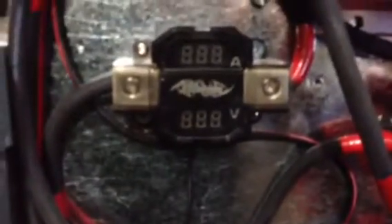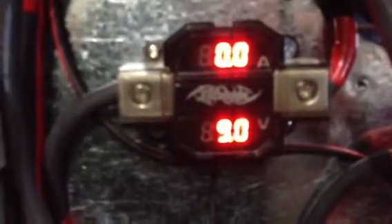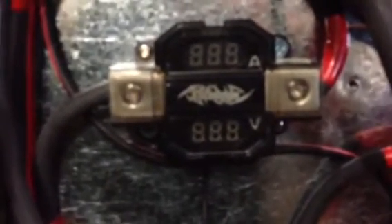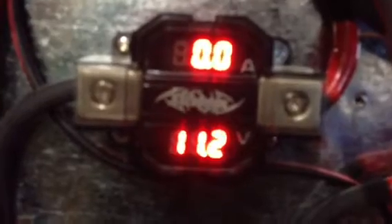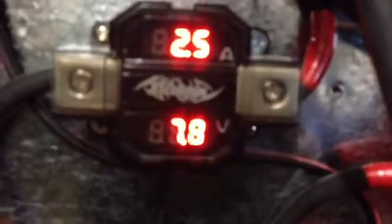The wind wasn't doing anything at that moment of course, but there it goes — putting in like 9 to 10 watts. The amps are anywhere from about 1.5 to 6 amps. Volts are going 10, 11 volts, then 0 amps, 3 amps, 1 amp, 13 amps — very variable. It's kind of neat to watch. This wind output is going right into the grid tie right now.